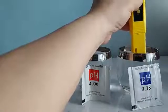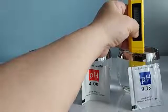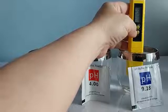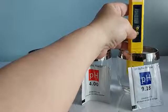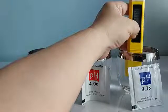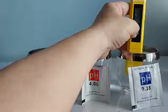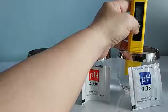Click the ON button, dip it in the solution, and click CAL for three seconds — one, two, three — release. It will start blinking until it's stable, then press the CAL button again. It's showing 9.31, and I'm not happy with that, so I'm going to press the CAL button again — one, two, three — release. It will blink and show 9.18. I'll press CAL once it's stable. I pressed it at 9.20, so it's about 0.02 away, and I think that's fine.